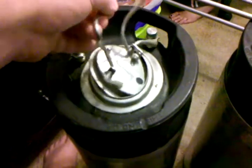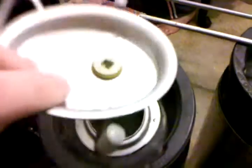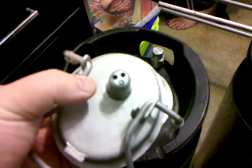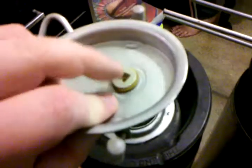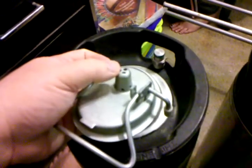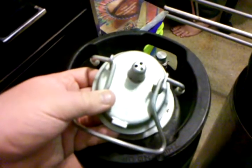These just lock in place — you get one end out, then turn it and the other end comes up. Here's another design that came with these kegs for the lid. This one does have a relief valve, but it's sort of an emergency relief valve — it's designed so that if there's too much pressure inside the keg it will automatically vent, which is not necessarily a good thing. You don't want it to explode obviously, but these kegs can take an astronomical amount of pressure.